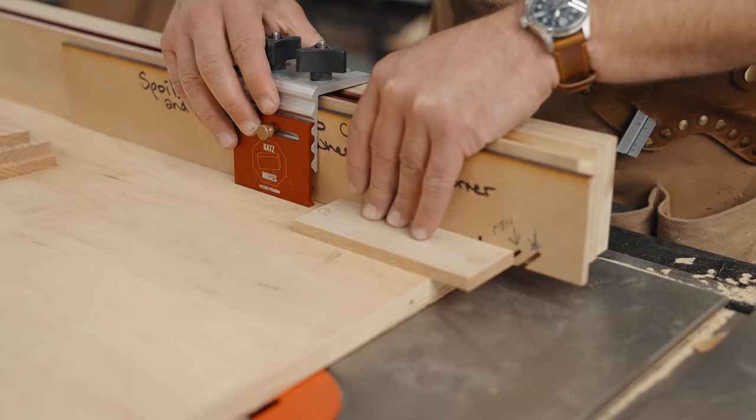I'm going to show you this in real time — not slowed down at all. It's so incredible. Wood only moves about a quarter inch over eight feet, especially white oak, which is very comparable to walnut. You can see there's like a 16th inch of play in here, so there's no chance this will ever get too tight and the trays will lose that piston fit.